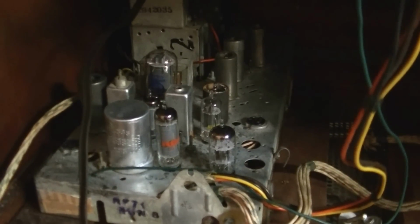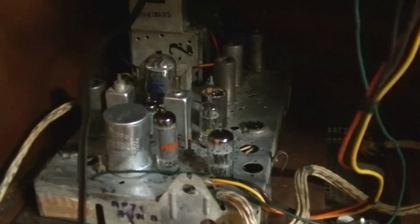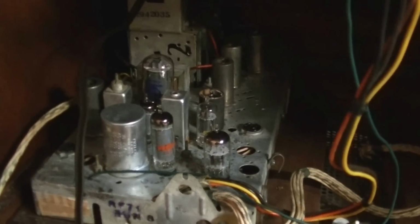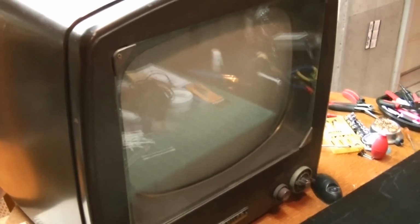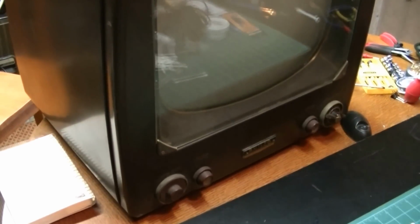They're really easy to work on, and they make a great picture when they're operating correctly. So I know I had sworn off acquiring any more Philco split chassis. The only problem that I have with them is in regards to alignment, or actually bench testing the chassis. I'm sure back in the day, they had cables that would interconnect between the chassis so you could put them out on the bench. And then using probably a test CRT, you could connect it all and have the chassis in position where you could work on the underside while it was operating. And since I don't have those types of cables, it makes it very difficult to do any testing with the chassis out of the set. But oh well.